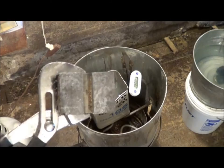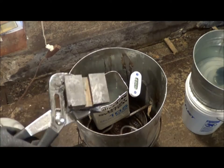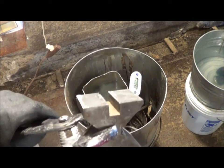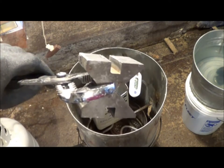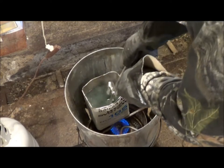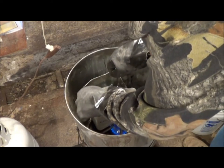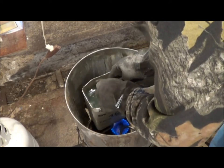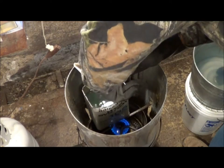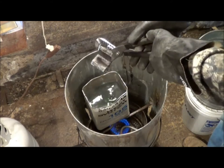We'll do five minutes. Just got it out of there after five minutes — it is gray, but I still see some rust. It might be almost too much light; I'm going to try switching a setting on the camera so you can get less of that glare. All right, we got the bell — five minutes done. I actually dropped this thing, and it's a good thing it didn't hit the acid because it would have splashed. Definitely want to have safety glasses on, effective gloves, and a mask. All right, so that would be 10 minutes.